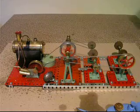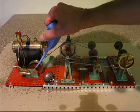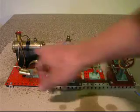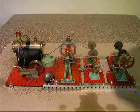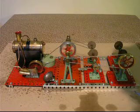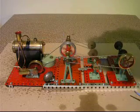One of my bands just came out - didn't screw that tight enough. As you can see it's running without too much problem. These little SE1s and SE2 versions were very short stroke engines so they spin rather quickly. They also have, like the early wheel tools, a brass flywheel which was a particularly attractive feature. Sadly this was discontinued around about 1953 when the cheaper Mazac items were introduced to keep the engines competitive and at a realistic price point.